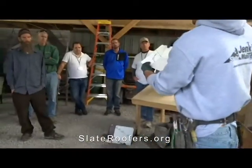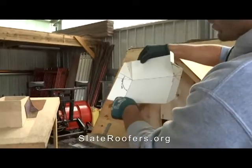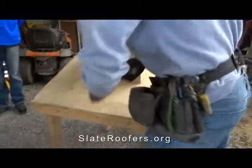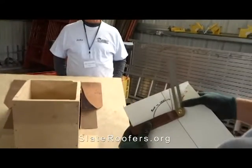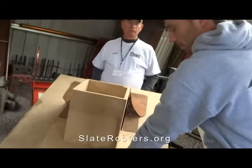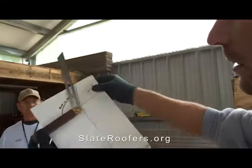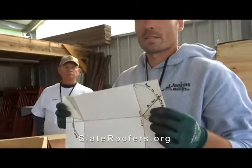This is the same thing but showing it in paper — it's easy to fold and you can kind of see what's happening. The yellow area is the pocket — that's copper we don't need. This is the angle: if I took a T-bevel, laid it on the roof, found the roof-to-chimney angle, and transferred that to this piece of paper or copper — that's everything I need. Everything else I want to get rid of — that's what that yellow section is. That's where the pockets form. Once you've found the angle, the rest is the pocket, and you have to bisect it. That's a key thing with pocket folding.